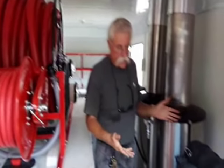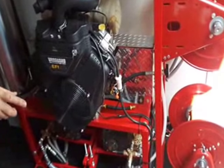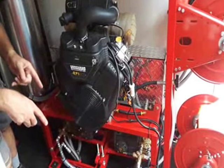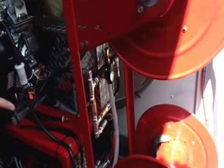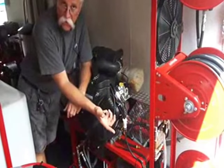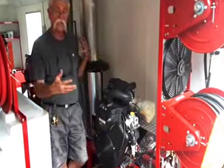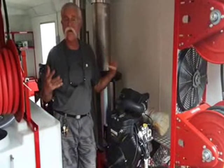Here's your pressure washer — it's a 37-horsepower fuel-injected Briggs & Stratton big V-twin monster with dual pumps rated at 7 gallons a minute each. This one is set up to be 12 gallons a minute total, so 6 gallons a minute each. He's also got a secondary regulator on here, so with the flip of a valve, one pump can be running at 1,200 to 1,500 PSI for doing tile and grout inside a convenience store, while the other is outside using 6 gallons a minute at 4,000 PSI for cleaning the islands or sidewalks. This is a very multi-functional system, totally adjustable for flow and pressure.